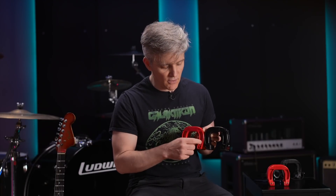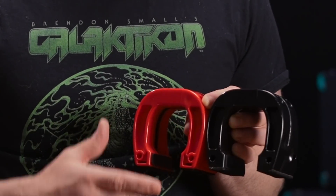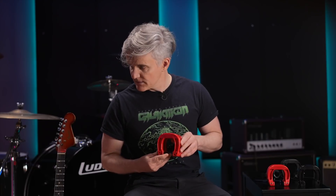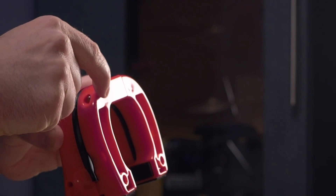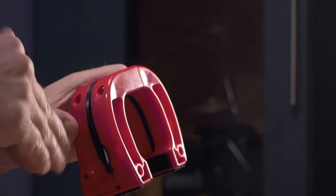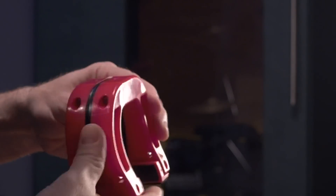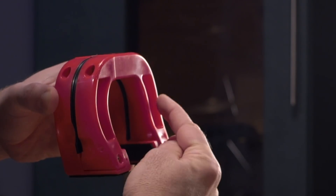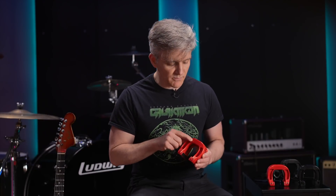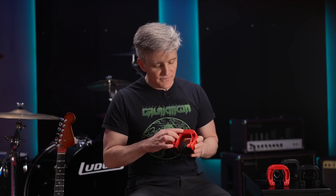These parts of the magnet were hollowed out as part of our original design, and it works really well for injection molding because you don't want a really big fat piece of plastic — it won't cool properly and you'll get what are called sink marks in the finished result. There are actually still a few of those here; if the light is hitting it right, you'll see a little divot on both sides. That's a function of the plastic up here being thicker and not quite cooling properly — similar to putting too much joint compound in drywall and having the center shrink as it cures, leaving a little sand trap shape.